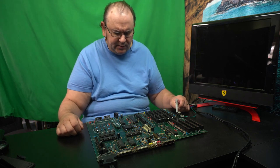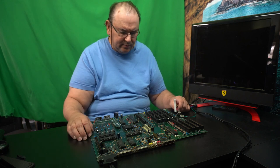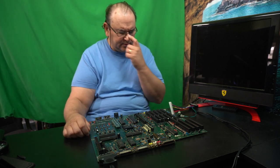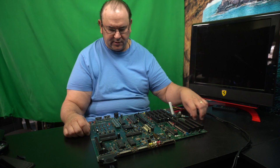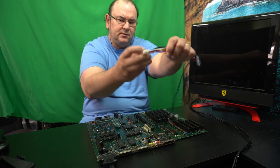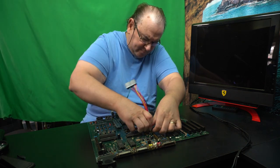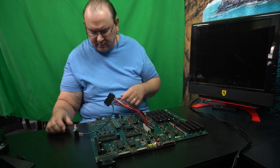I've never really been sure why the Amiga 2000 platform has a tick signal. On the Amiga 500s and so on, there's no tick signal that comes from the power supply, so it's unique to this. And why would you have both options? Beats me. Original design decision, 30 years ago. So anyway, this here has a bridge there, and as you see, this has a holder there, so it needs to plug into here. And actually not that easy to take out again. And then we have the switch.